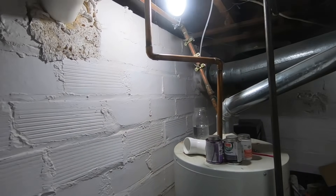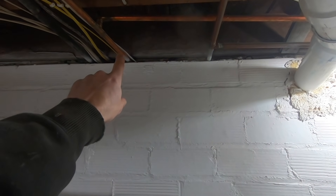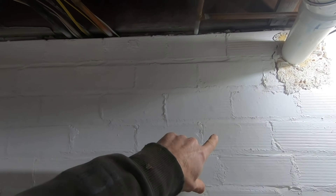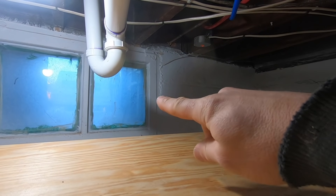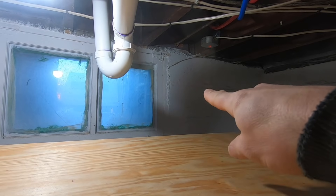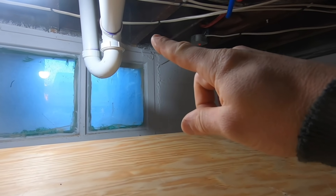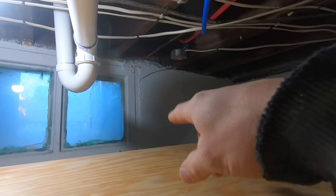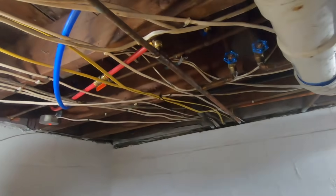We are here and we're ready to go. There's the old water heater there, and we're going to mount the new one right here. I'll bring some 2x4s down off that floor joist — that way I don't have to drill into the concrete block. So we're going to go out through one of these sills here. There is a porch out there, so I'm going to go outside to this window and measure over to see how far I can go and where we're going to have to get our exhaust and intake pipes out. In these older houses, there's always all kinds of stuff going everywhere, so we're going to try to make this as clean and installed as possible.